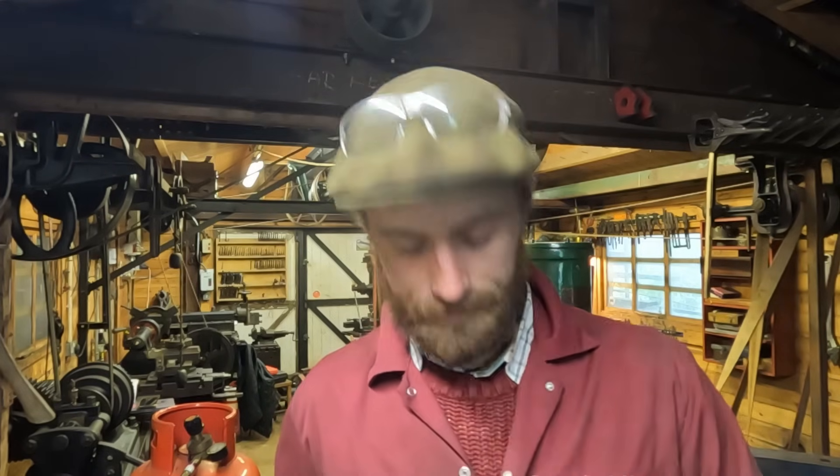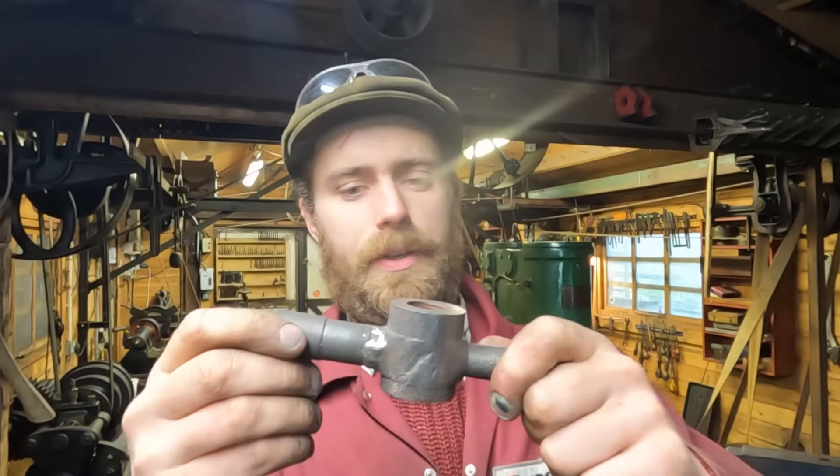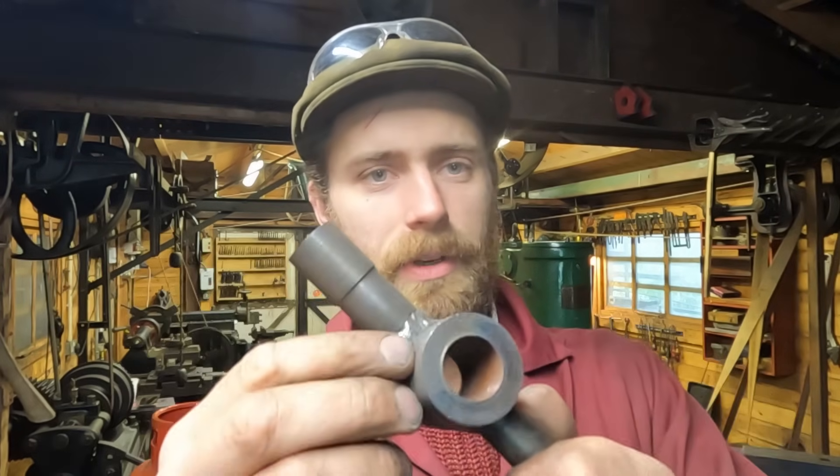It's now the next morning and both parts have been allowed to cool down as slowly as possible. It's especially important for complex castings like the wheel — that one was placed back in the furnace and allowed to cool down in there. Before we look at that though, I want to remachine this little lever.